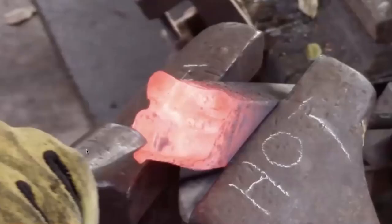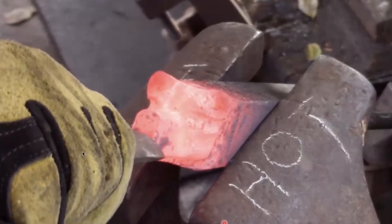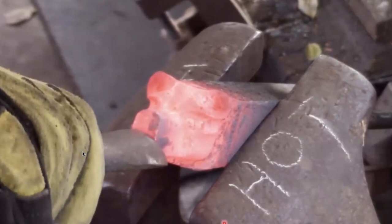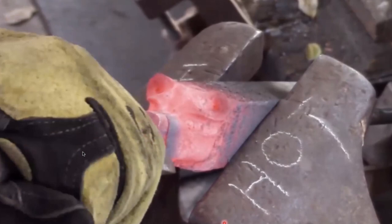You can see just from the start that I'm coming in at that two-thirds level. In fact, I may be a little high here. So let's see what I do with that. Coming down a little bit, there we go. And then I want you to keep an eye on the angle of the tool. Lift up, push down. I'm just trying to dictate how that cut goes. I'm feeling like I'm just a little low, so I might lower my tool, I think. There it is. Yeah, there we go. Lowering the tool.